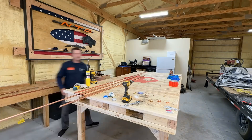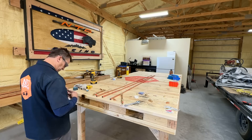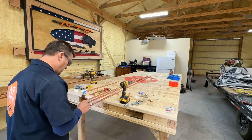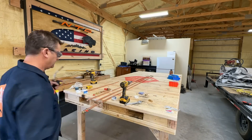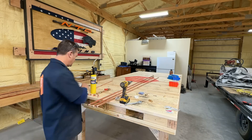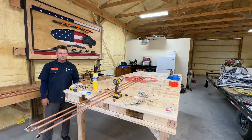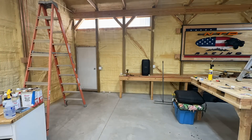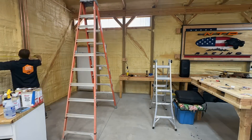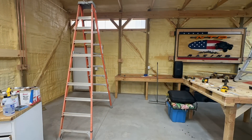When putting this thing up, I assembled most of it on the table and then brought the big parts up onto the wall. To hang it, I put a laser level across the top of the wall and then put some nails in so I could just hook the tubes onto the nails. For the parts that would go together — usually an elbow — I put the elbow on the part I was bringing up to the wall, so I could hook the elbow onto the existing piece. That held it in place while I went up there and soldered it, making it a pretty easy process and minimizing the time I had to go up and down that ladder.